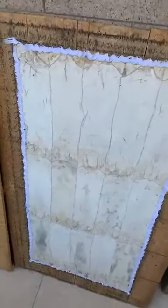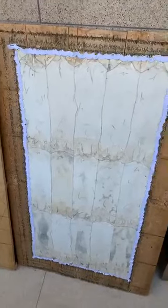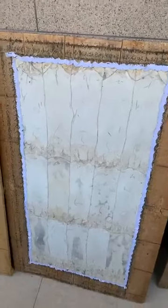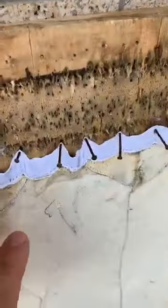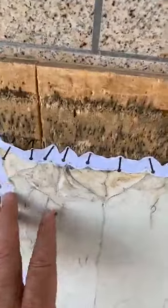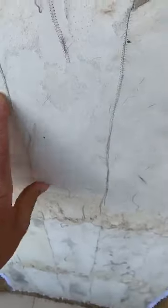Once they get them done, that's not all there is to it. They actually wet the backs, and they're a little damp even when they sew them because they're easier to sew - the hair is not so wispy and poofy, and it goes through the machine a little easier. Then what they do is called blocking - they block it out. You can see they don't put the tacks into the skin itself but into this piece of material - a lot of people call it tape in the fur trade. Then they let it dry in the sun, stretched out like that.